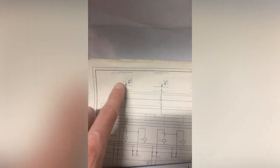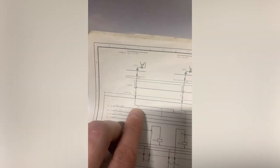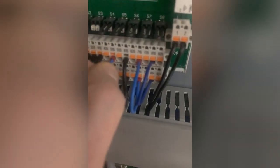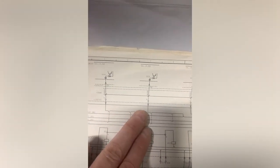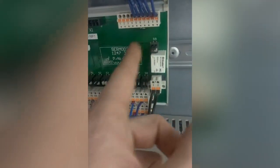Just before I go, I have to notice that each one of these inputs to the PLC for these individual readings of what's going off is via this plug. Well, this plug's just pulled off now, so assuming they're all normally closed, they're not, they're normally open, look. Or are they breaking? I don't know, but I think after that it clicks, so I'll go to the controller and see if they've all come up. Because if they've all come up now, I can prove that this is not at fault, and then I really am working on this bit.